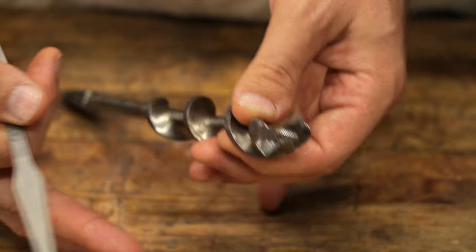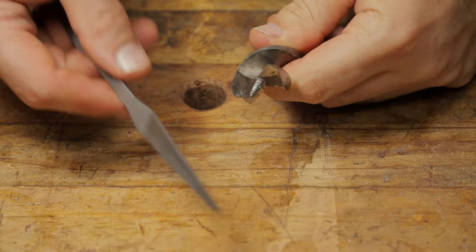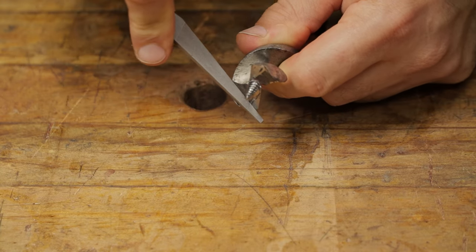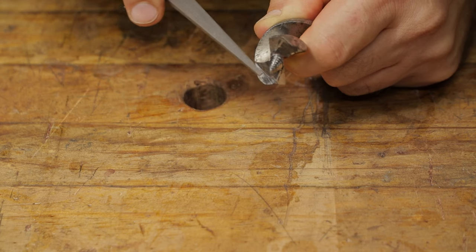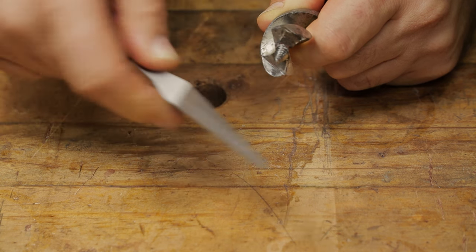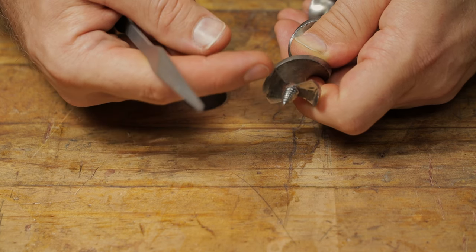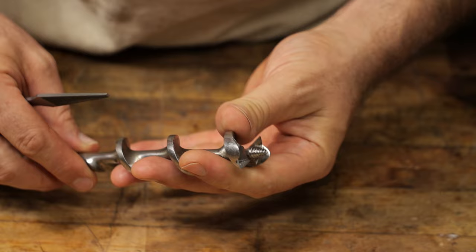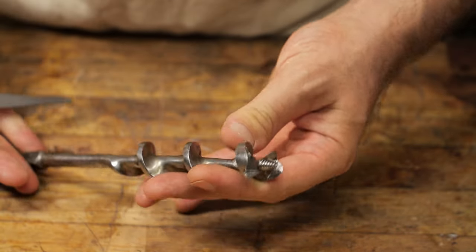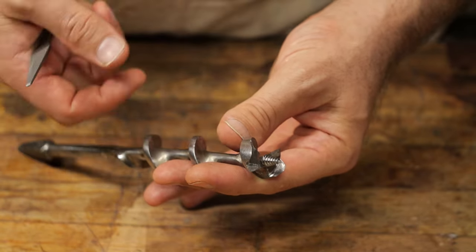So now that we've got that out of the way, let's get into the sharpening. I always start on the wings first. I take the big flat edge, put the safe edge against the auger, and move the auger file through that wing, making sure to get full contact across the whole thing and ensuring a nice sharp edge right the way through. We can look for any flat spots on the top to know whether that's occurred. We work until we can visually see it's sharp. You'll probably end up with a little burr on the outside — normally we'd remove that burr, but because we can't touch the outside of the wing, that burr will just break off the first time you use the auger bit, so there's no reason to remove it.